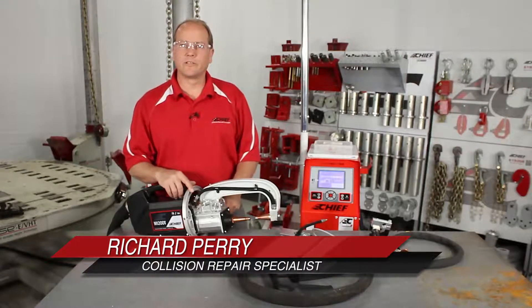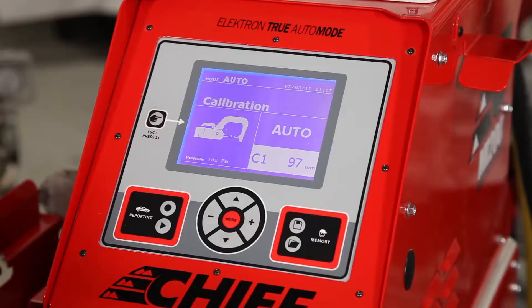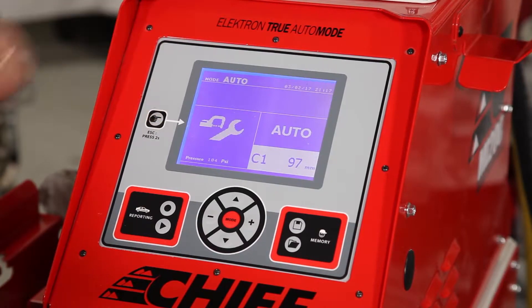This is going to show you how to install the single side gun onto the MI200T. First thing we need to do is go into the service mode. This shuts the pump off so no fluids are released during the installation of the gun.